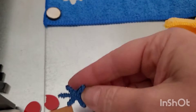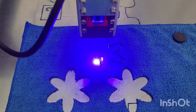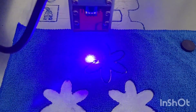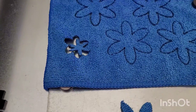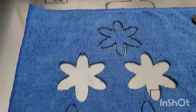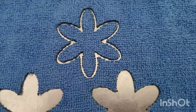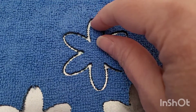I think this may be the winner of my settings because it does look like it's cutting all the way through. It's 80% power and a bit faster at 300 millimeters per minute. I've been testing lots of different settings and I think I've zeroed in on my favorite — it looks like it's cutting all the way through, it's not melting the material nearly as much as my first try. So 80% power, 300 millimeters per minute using LightBurn.